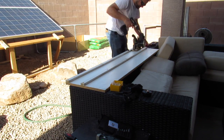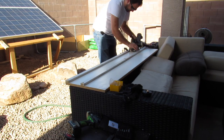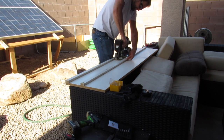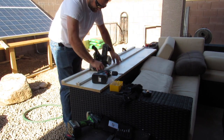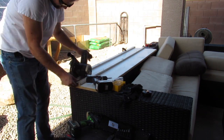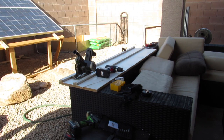And then I'm going to slide the saw forward and backward to make sure it runs smoothly. And then with the piece of paper back in place, I'm going to slowly move it through the middle so I would eliminate any left and right bowing of the 1.5 by 3/4 inch pieces of wood. And I run it smoothly back and forth to ensure that nothing is snagging as I go back and forth,